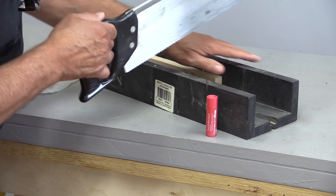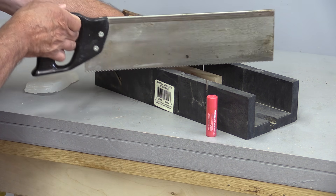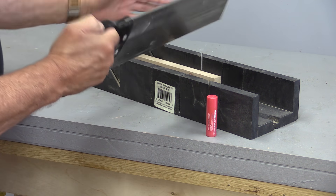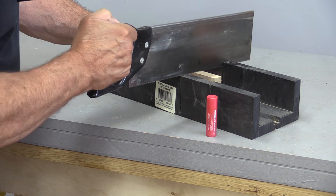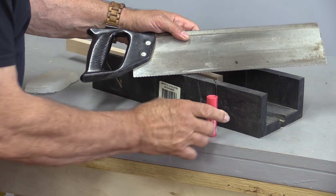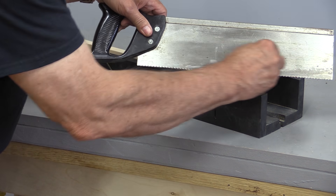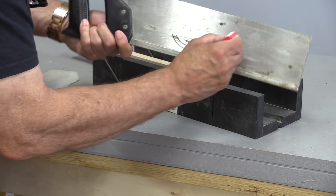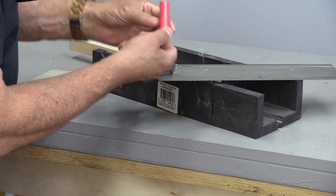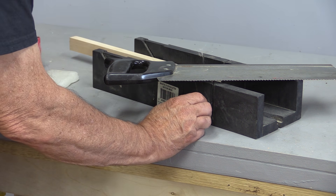This tip is from Michael. Michael's talking about using a miter box — we use that for getting perfectly straight cuts and different angles. When you're doing that, very often the back saw, like this one, will bind as you're going through, especially on angles. So what Michael uses is a little bit of chapstick, and he just puts a little bit on either side of the saw. I've got some pink here — you typically wouldn't use pink because it does leave a little bit of dye on the wood. But there is natural, and it does work. In a pinch, that's a great idea.